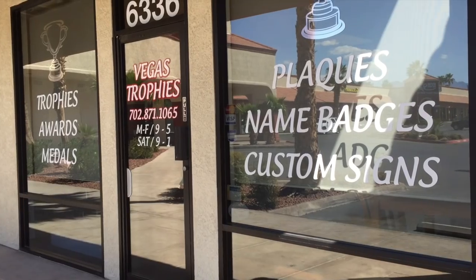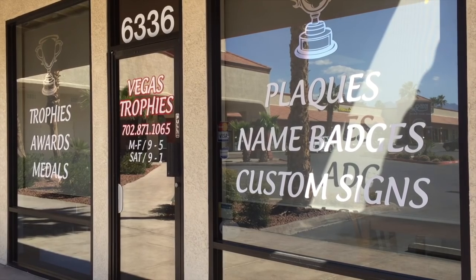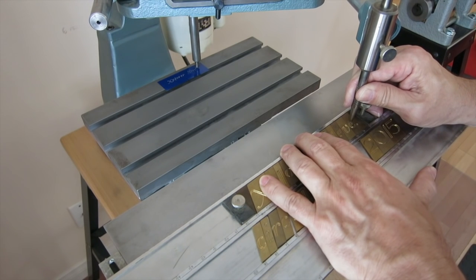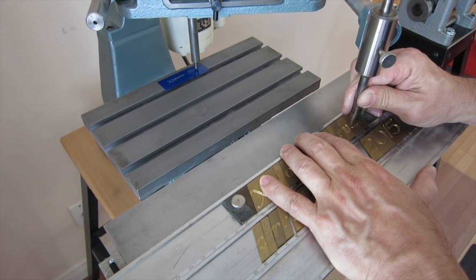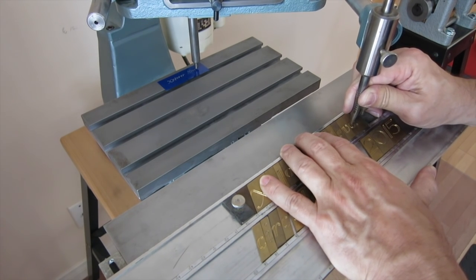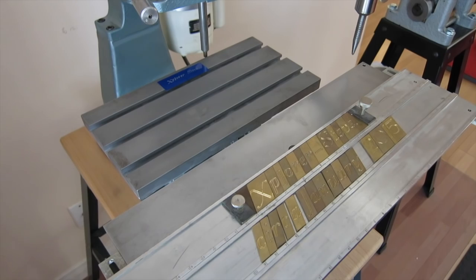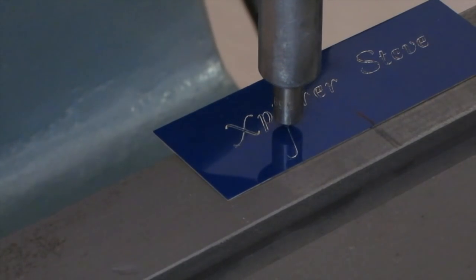That's when I started my channel. I needed something to engrave on, so I took a drive down to a local trophy shop in my area, and for the price of free I came away with a couple of engraving blanks in royal blue. I fixed the blank on the table with just some double-sided sticky tape and started the process of tracing the letters on the top platen while it's transferred to the bottom platen. I have to be careful to lift up the diamond drag between each letter so I don't make a scratch mark from one letter to the next.